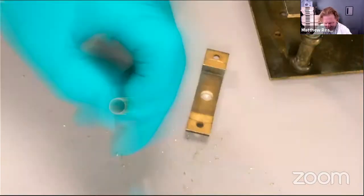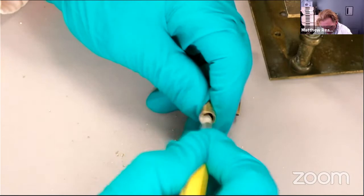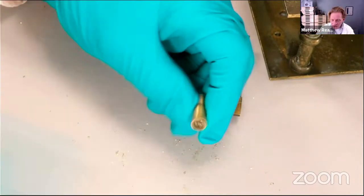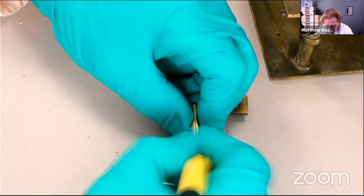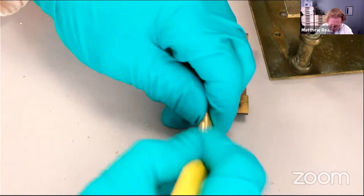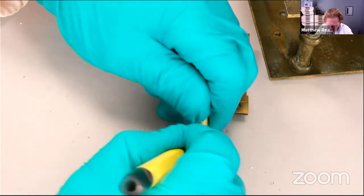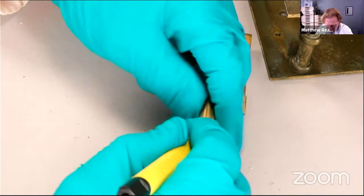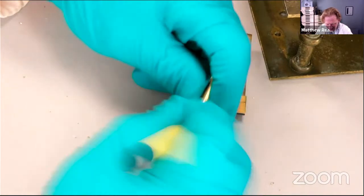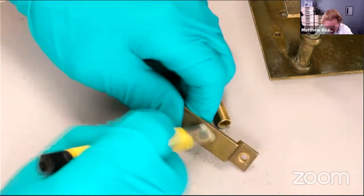So I'm just going to use the fiberglass to clean up the end of the pipe where the casting is, because I don't want to get rid of that casting mark, because that's where it locates with the other components. I want to keep the unevenness of it, but I want to get rid of some of the tarnish. Maybe I'm probably overthinking this. That's probably because I don't really want to do it, because I've got a feeling it's going to go wrong. But anyway, there you go. Won't be the first time. So the same on here, just around the edge.